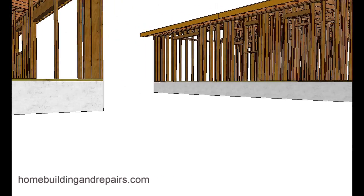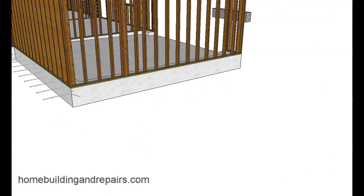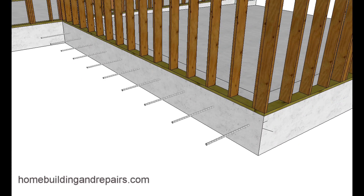If it's, say, eight inches, you know it's got to go in another two inches. It's really a good way to gauge how far the rebar is actually in the footing. Then of course they will need to be bent down — you can do that by simply grabbing them; I've actually stood on them before. Try not to over-bend them; do it gradually. You don't want to be bending it, pulling it back, bending and pulling back — it could weaken the rebar.